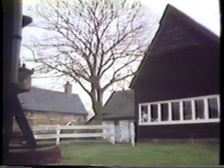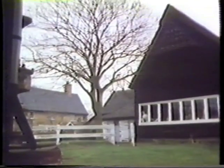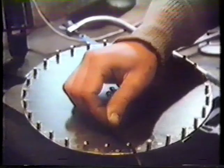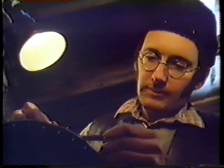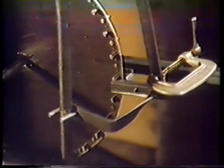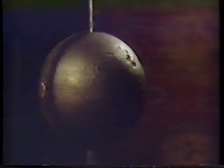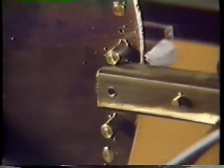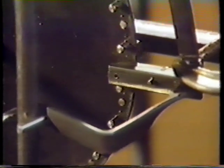By day five, Tim was really into the prototype stage. The main problem now was friction, and those nylon pallets were also giving him problems. He first put the pendulum weight in place temporarily because the swing was terribly jerky, and smoothed the corners of the pinwheels down where he'd flared the edges in riveting. He also made the angles on the ends of the pallets less vertical, giving the pendulum a stronger push — not exactly a deadbeat mechanism anymore, but it worked better. All the things he changed improved it to one extent or another, but he didn't really like the noise it was making, and began to think nylon would wear out very quickly. So he decided to try a set of brass pallets, partly because it would make a nicer noise.